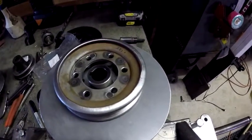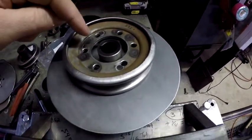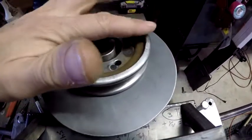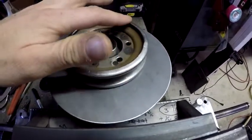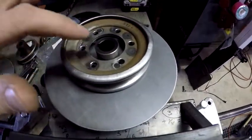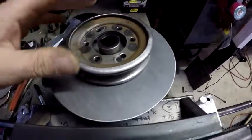So to do that, I bought some quarter-inch thick aluminum, three inches wide. I've got to take a hole saw and cut some circles out, clean them up, put this bolt pattern in there, and then space them up until they come just proud of this edge. And if it doesn't come proud of this edge, I can chuck it in the lathe, turn this down a smidge, or just take a sander and sand it down — just so that when those are stacked up on here and I'm tightening stuff down, it's putting pressure on here to lock everything together.